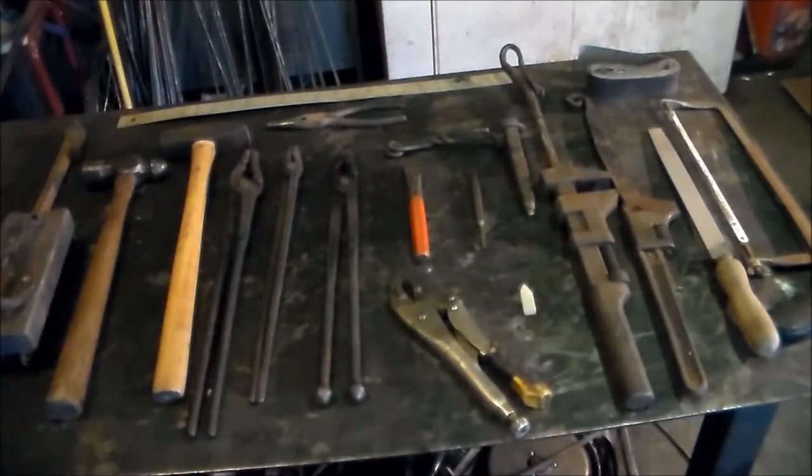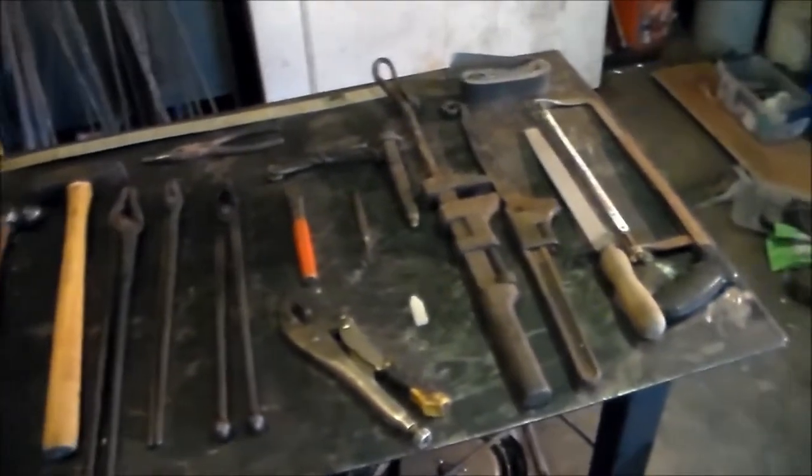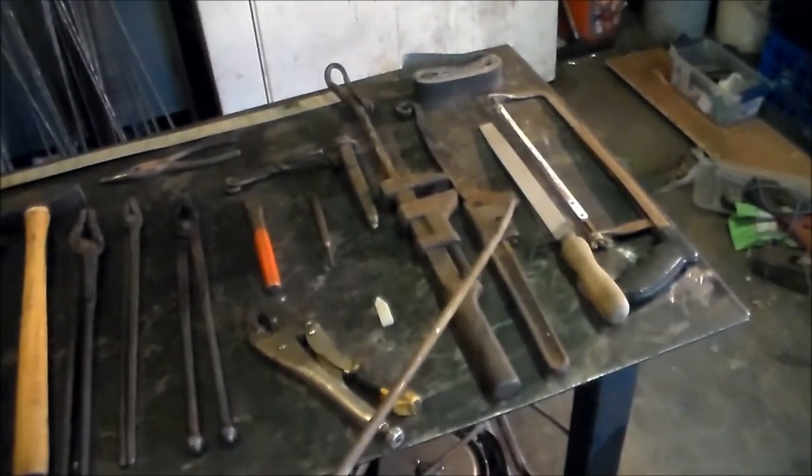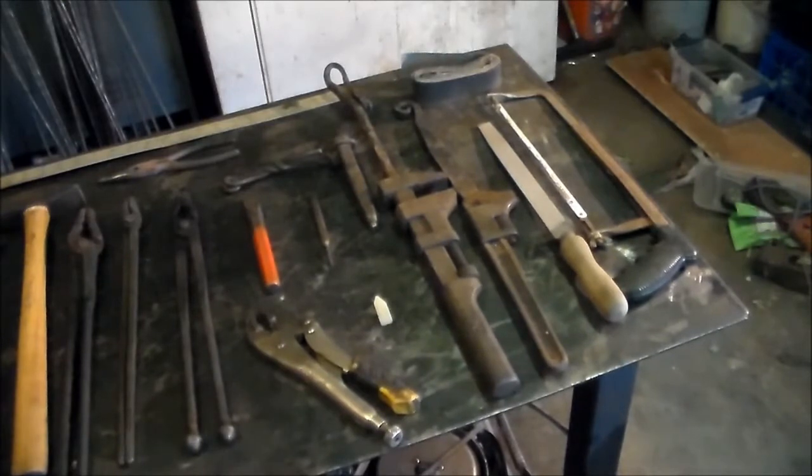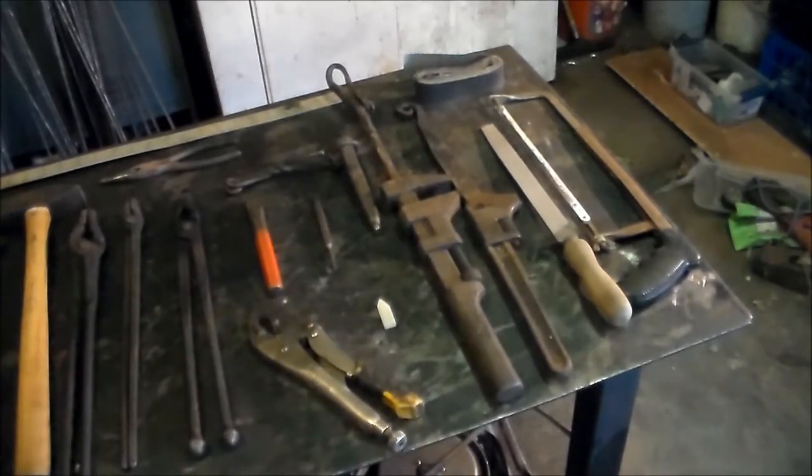Here I've got a couple of twisting wrenches — they look really specialized, but they're really not. This is just an old auto wrench, and this is an old sliding jaw wrench. I got them at a flea market for probably less than $4 apiece, then welded a handle on the other side so when you're twisting you can use both hands. I know several guys who use a crescent wrench with a handle welded to it. If you don't weld already, make friends with somebody that welds, because having the ability to do a little bit of welding will really increase your tools and jigs and make your work a lot easier.